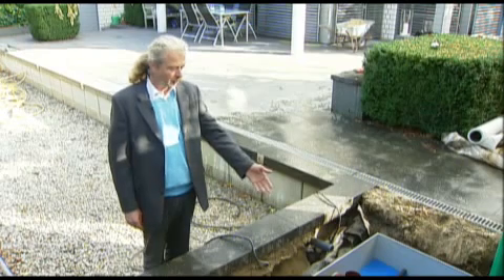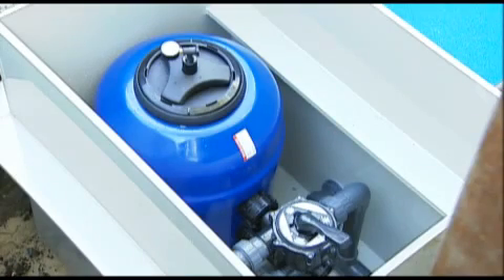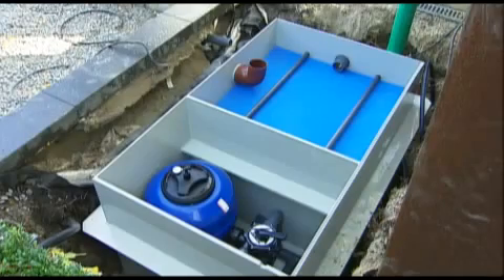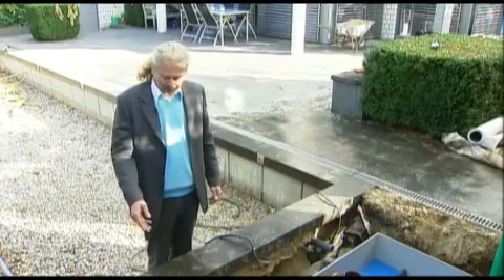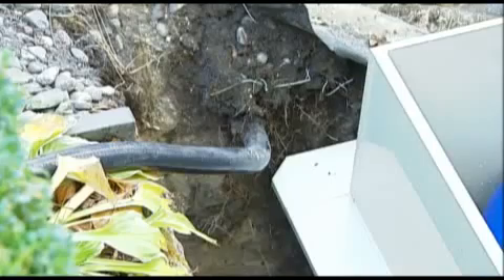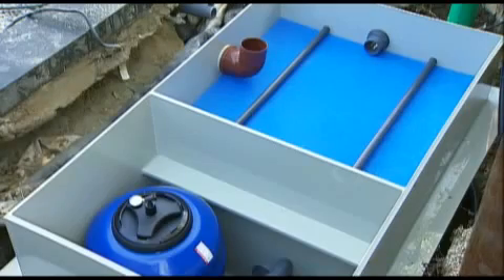The converter system is comprised of a biological filter, which you can see on the left here, and of a small pump which uses very little electricity, a phosphorus filter and a six-way valve. All components are combined in one unit and are delivered to the building site pre-installed. Here we can see the connections which we will use from the existing system — here the suction side and here the pressure side. Thus the existing pools can easily be converted without much effort in terms of construction.